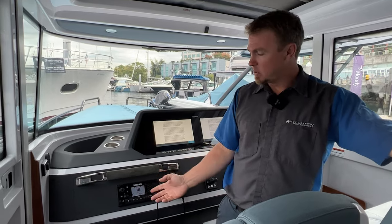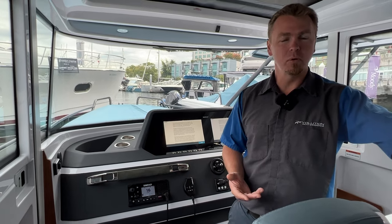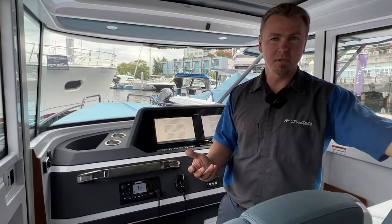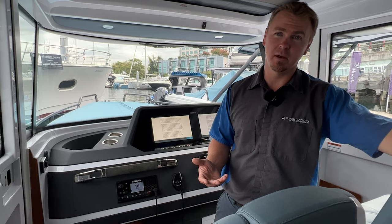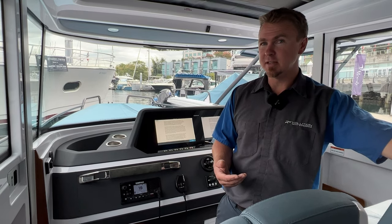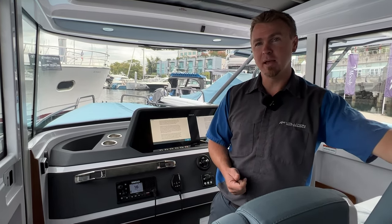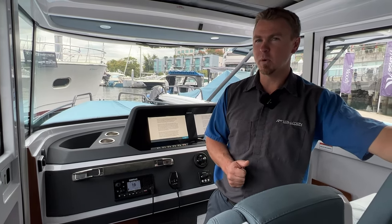Okay, so from channel 16, most of your calls, I think, in general operation will probably be hailing a marina when you come in. That seems to be the most common thing that people do with their VHF. And it's something, at least here in the Pacific Northwest in Canada, that people will be required to do in order to get their slip assignment for the marina. Most marina staff will operate on channel 66 Alpha. So 66 Alpha, you'll see that on a lot of websites or handouts or forms or emails that you get if you make a booking with your boat at a marina. If you're going to be a transient or have transient moorage, they'll typically tell you what their channel is, and it is almost always 66 Alpha.